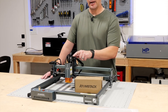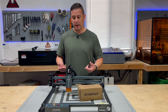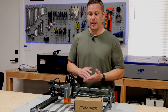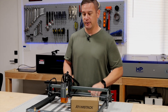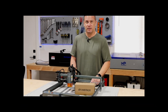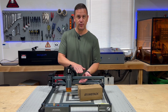The other thing that this autofocus Z-axis has allowed us to do, which we haven't been able to do in the past, is the step-down after each pass. This step-down feature allows you to cut through thicker materials because the focus point gets lowered after every pass. We don't have a more powerful module here — we're limited in the power we can put out — but we can change where that focus area is, where that power is sent to the material, and by lowering that each pass we can cut through thicker material. There's potential to cut materials about four millimeters thicker than before.